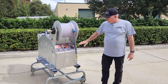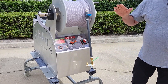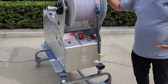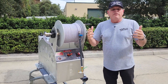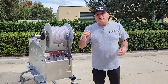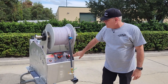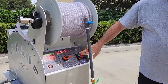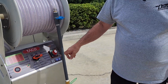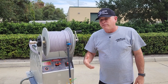The first thing you'll notice on the Soft Washology Taco is a very nice, tight control panel. This control panel is designed so that when you sit the Taco in the back of a pickup truck, on a flatbed, on a trailer, or inside a van, it gives the user access to the most important controls for their soft washing solution. First, you've got a marine-grade on/off switch with two different positions for controlling the system. When you turn the power switch to position two, it powers the pump.